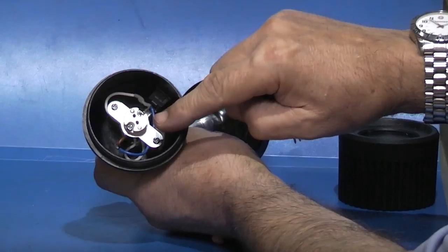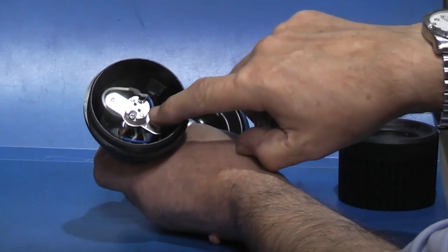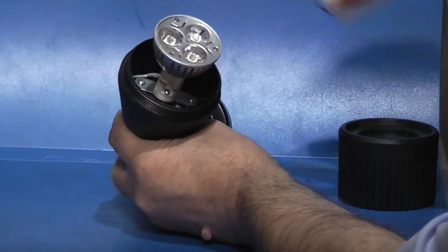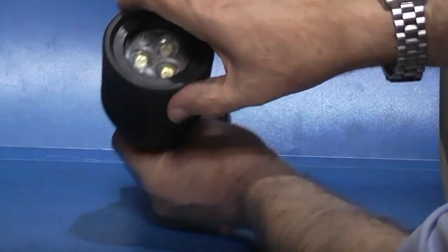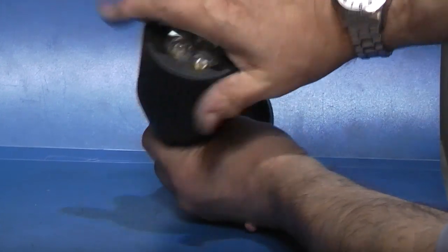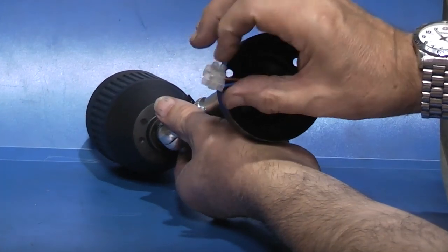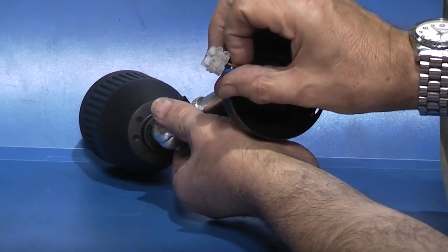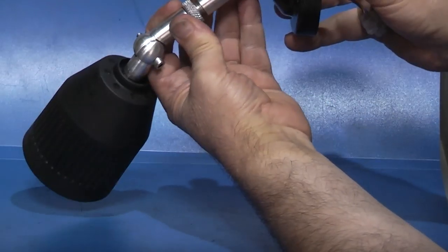That's both ends in. On this end, I fitted the switch, wired it up, and fitted the bulb holder. So the bulb goes in there, and then the top goes on. All I need to do on the other end, I've put a little connector block. They were crimped cables with just a bit of plastic over them, so I've replaced that with a connector block. Connect that to the machine and bolt this back on the machine, and then we'll test it.